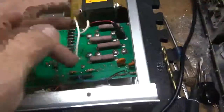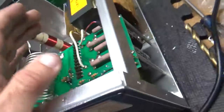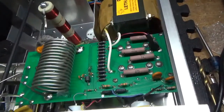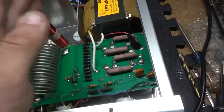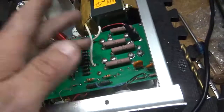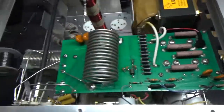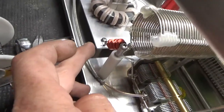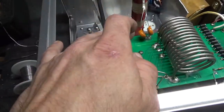The assembly is back in. I'm going to pull out the pink resistors — these are prone to failing. Caps are good, newer style. I'm going to put good resistors in; caps will last for years and years. The resistors, from what I've seen, are 99.9% of the time the reason why the cap fails — and it's the pink ones that fail. Also don't forget to reinstall your safety choke. That stops DC from appearing on your output coax if your plate blocker or plate blockers were to fail, depending on how many are in the amp.